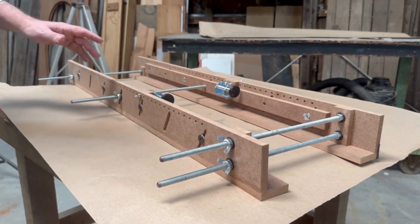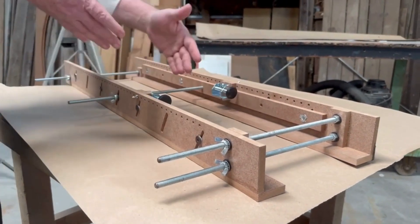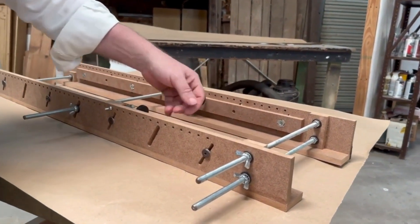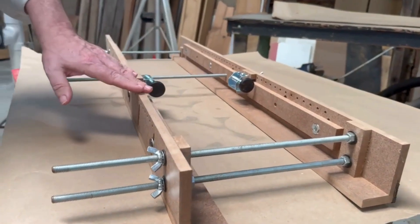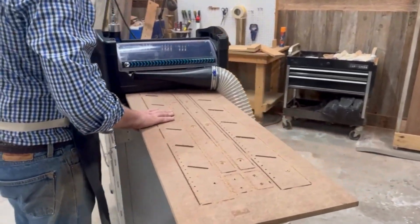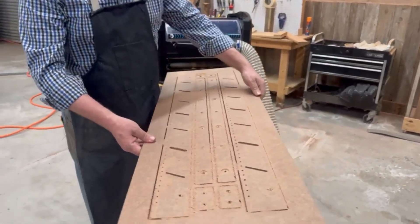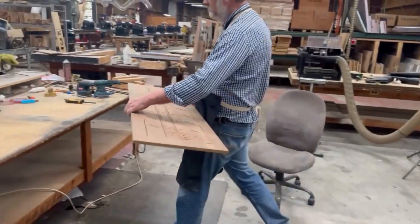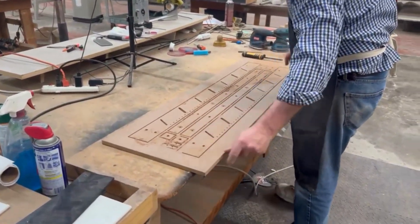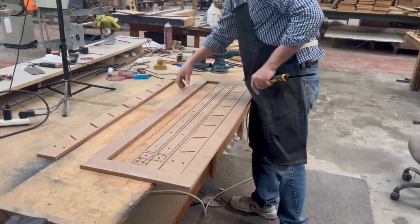Here is a universal jig. This jig is capable of handling up to a 36-inch long board, 14 and a half inch width, and a thickness anywhere between an inch and a half down to a half inch thick. This jig is constructed from one piece of material measuring 15 inches wide by 48 inches long. Material thickness is a half inch, to be made from MDF or plywood — any flat material.